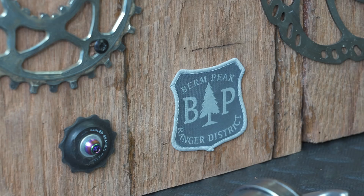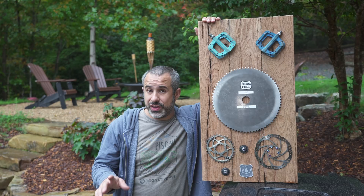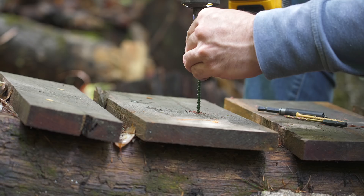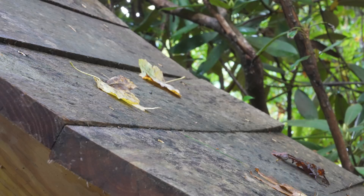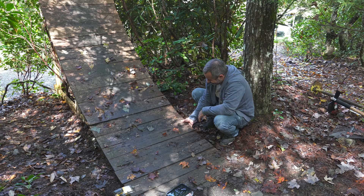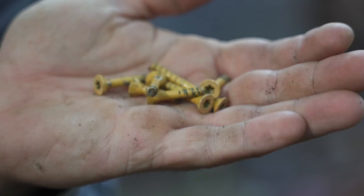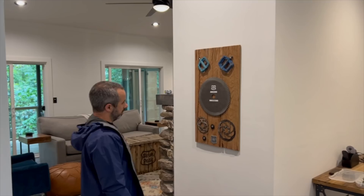I'm really proud of this thing. We've got guests in the house for the next few days so we won't be able to hang it just yet, but I hope you enjoyed us doing some chores around Berm Peak. I learned a thing or two by inspecting all those features. We should probably be using longer screws when the mounting surface is suspect. Also, we should always ensure that planks have some space between each other, because when you put them right next to each other, the expansion and contraction will actually crack the screw heads loose. I hope you learned something today, and thanks for riding with me.